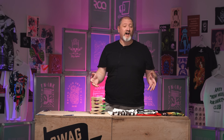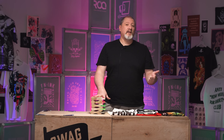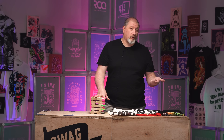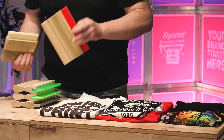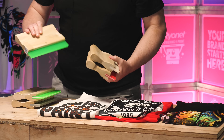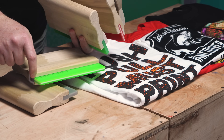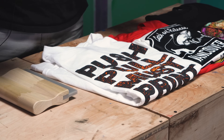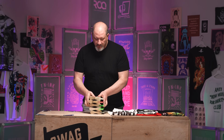As far as colors go, you're going to see a lot of different colors available from different distributors. If you buy enough at a time, you can request whatever color you want in a squeegee blade — it's not uncommon to see yellow or orange 70 durometers. So don't let the color of the blade fool you. Always double check on the blade itself — the writing on it will tell you the durometer.